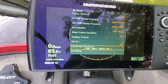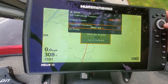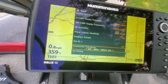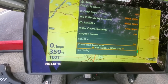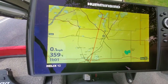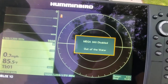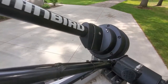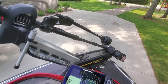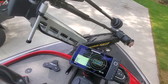Per the manual, you can select different transducers. The one we need to run is MDI Plus and then Mega 360, because we are running those two transducers. You can see right there it says 'Mega 360 disabled' — it's out of the water. Those two little silver sensors are water sensors, so this thing will not turn on unless it's in water. Either put it in a bucket in your driveway, or just take it out and spend the day messing with it.